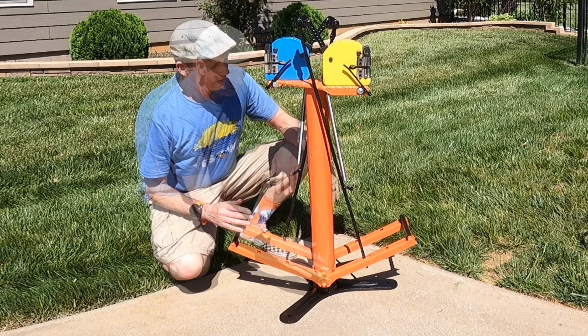The axle that the whole pedal assembly pivots on is made out of a Model A tie rod piece. Then there is a sleeve of conduit through the down post that it rides in. I made a bearing surface in there out of nylon zip ties. Back here I put a Zerk fitting in the end of that axle, and I was able to grease the entire assembly because I drilled a hole in the axle as well, so the grease would come out inside of the conduit sleeve.